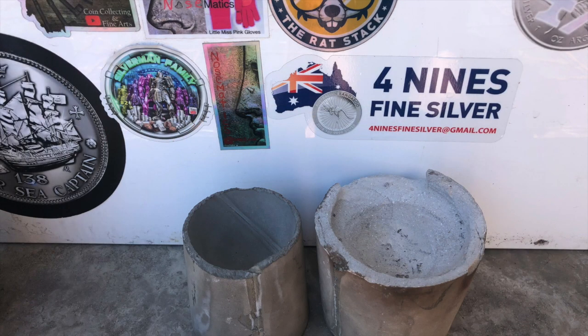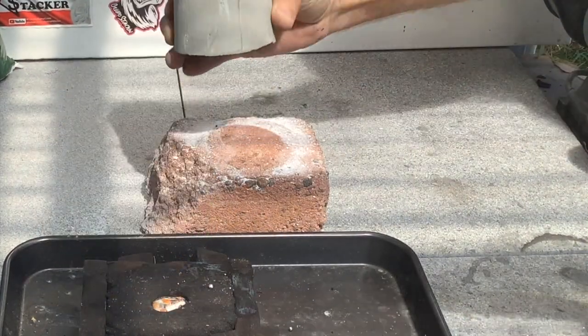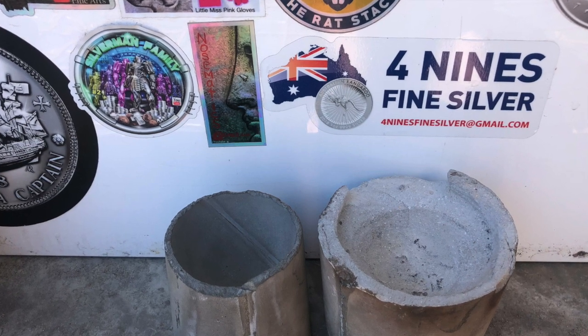All right, I thought we'd start off with the homemade crucibles. I made these right back at the start of my channel - I didn't have a contact to buy crucibles from so I thought I'd make my own. They've turned out to be rather good. You get about 10 or 15 pours out of them before they start to break down. If you're interested in making your own, check out the playlist in the top corner. They work quite well but I would only recommend them to a novice, someone that just wanted to see what pouring metal was like.